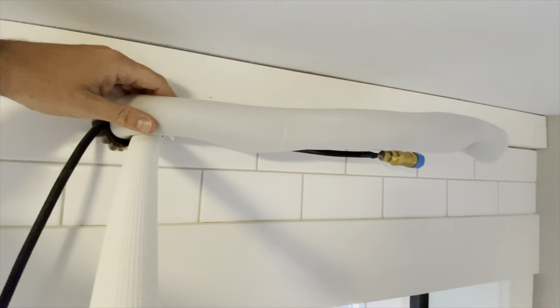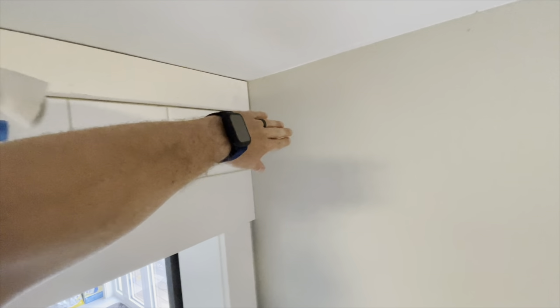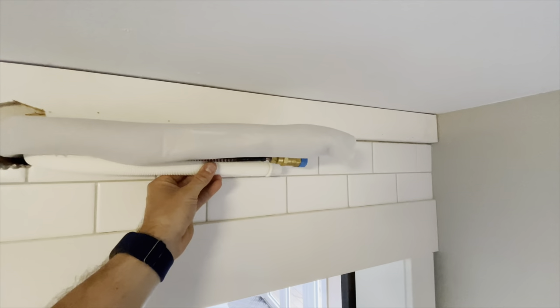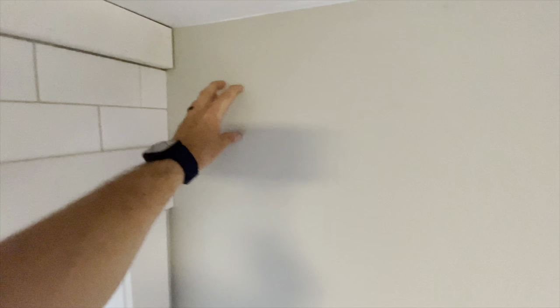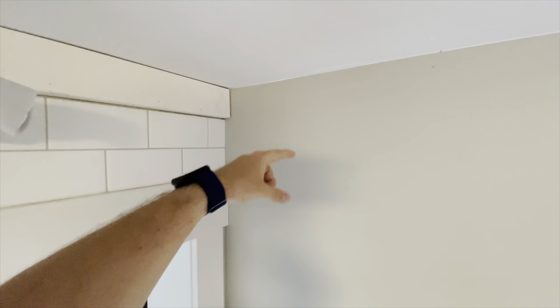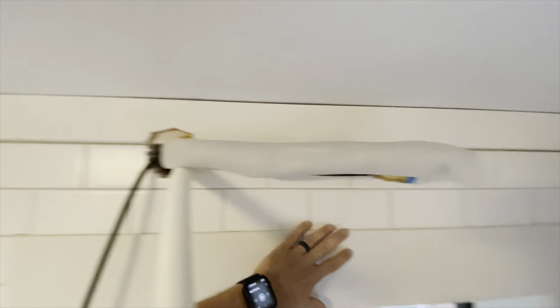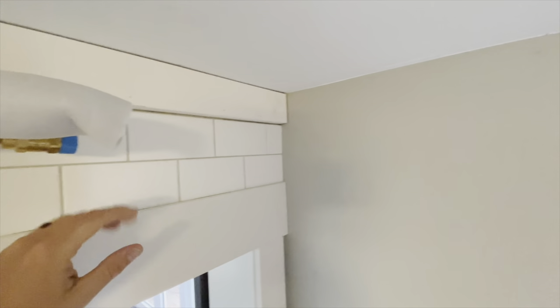So what I'm going to be doing is taking this out. I've already carefully bent this sideways, and I'll be taking it out the side here, making sure we have a little bit of a slope going down to maintain drainage for our condensate. I'll be cutting a hole right in here, and eventually I'm going to have to put some kind of — I think I'm going to do a faux beam — something across the top of this wall to cover that up. Otherwise it'd be pretty ugly.